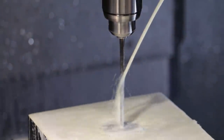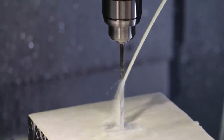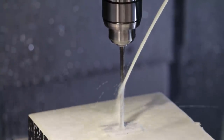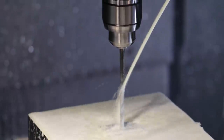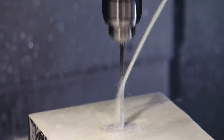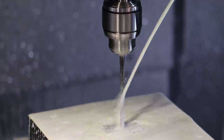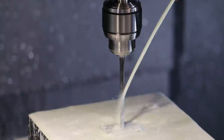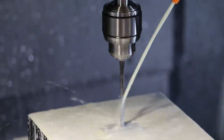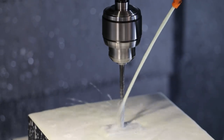Well, this looks like a good point to stop for this week as we watch the time lapse of the drill pecking occur. Next week, we are going to finish machining the components of the mold and assemble the mold with all the ejector pin cutting and the assembly of the springs and the bearings and everything. Followed by that, probably another show afterwards, we are going to load the finished mold onto the injection molding machine and dial in the molding of these plastic parts to get the molding machine to run fully automatic. And a sneak peek in the future, the molding machine molded one part every 30 seconds, I think, or 20 seconds, something like that.